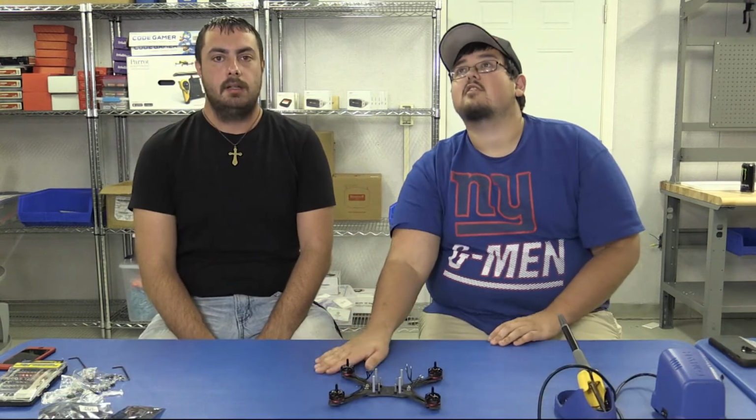All right guys, motors are now mounted, and we're ready to solder those up to the speed controllers. Now, an important tip, if you have never soldered before, I would recommend practicing before you try it on the kit. Pick up some old wire, some old computer parts you may have laying around. I'm sure the schools have those. Just practice tinning wires. I'll show you how to do that in a moment. Tinning boards. And just making a good joint.